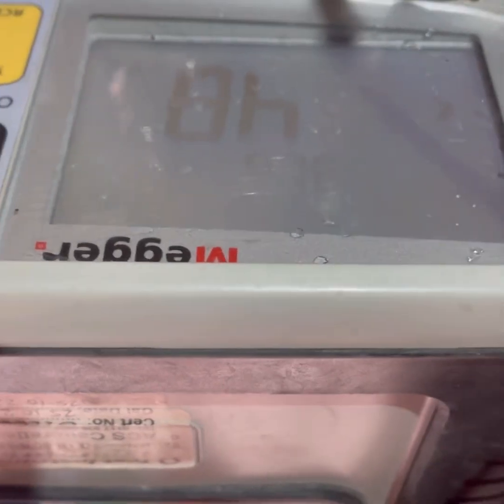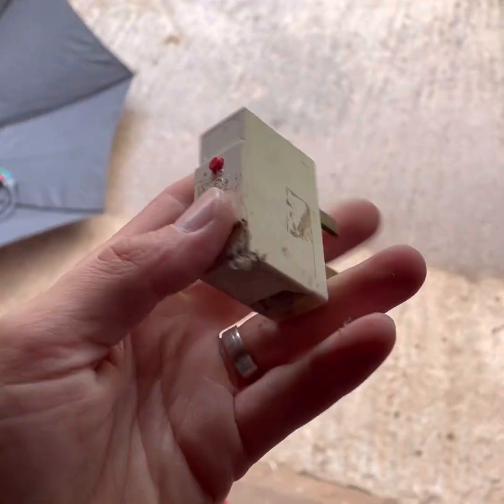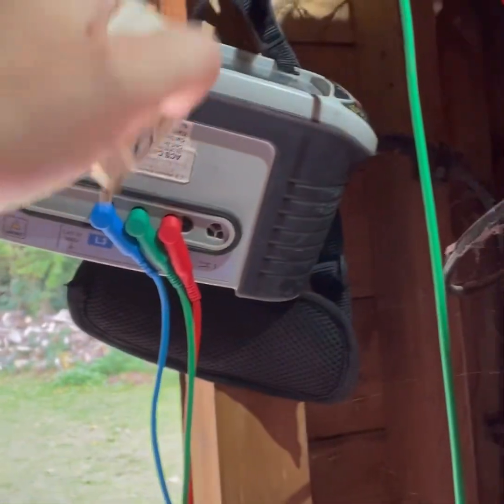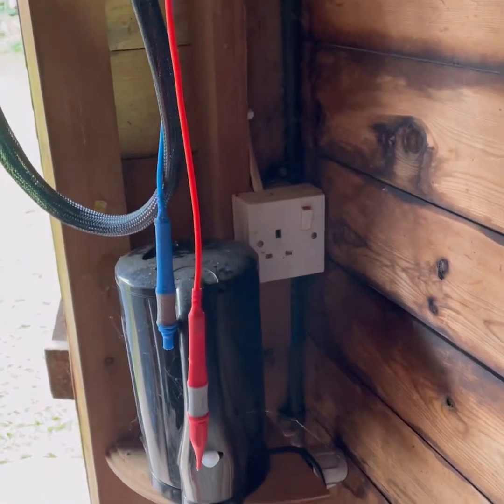I also really want to know what the PFC is - that's quite important. Result: 178 amps. That's actually good, and here's why: these push-in breakers had some rated at only 1kA breaking capacity - I believe the older ones were 1kA and the more modern ones went to 3kA. If your PFC exceeded 1kA you could have a fault that wouldn't rupture the breaker and wouldn't disconnect the supply. Luckily on this installation we're fine at 178 amps. But there's still no RCD protection, junction boxes not suitably rated for the environment, and plenty more to crack on with.